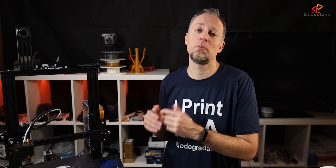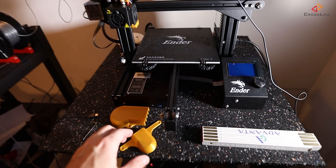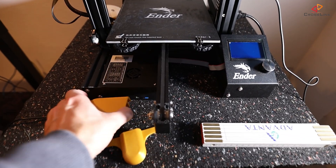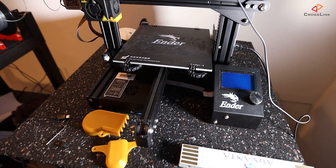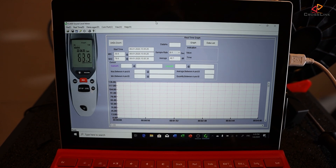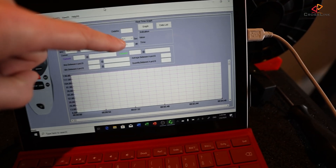To be able to compare the noise levels of the printer running on the old setup versus the new setup, I'm monitoring a print of a Benchy using a calibrated noise meter. So let's have a look at the setup. I've set up my Ender 3 here and I've also removed all of the sound dampening fan shrouds — one for the electronics case and one for the power supply — just to make sure this printer is in the most original state as possible. Above the printer we have the sound level meter connected via USB to this computer.